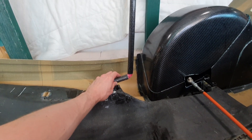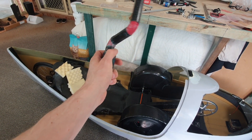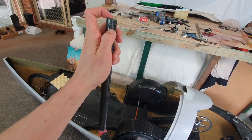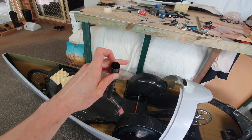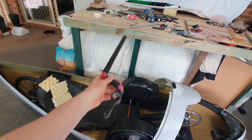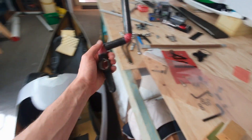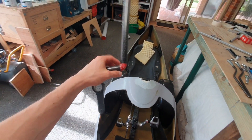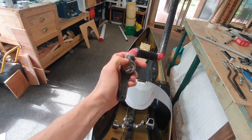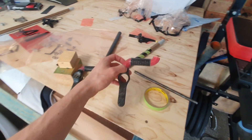What I'm going to do now is cut some carbon up to wrap around here and around all the corners and all up the entire length. I had to split it to get it off the conduit unfortunately, but I'll just put a little plug in the end and glue it in place just to hold it steady and stiff. I'll wrap that in carbon and stick it in a vacuum bag and suck it down so it's reinforced and super strong. I'm going to put quite a few layers around these elbow joints, and where it joins into the molded piece down the bottom.